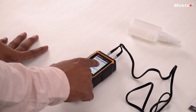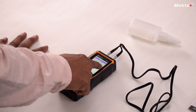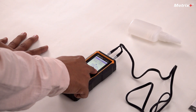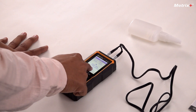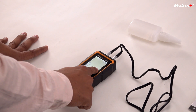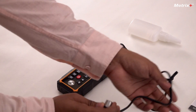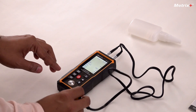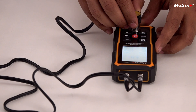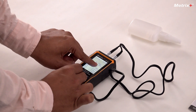So we'll select steel. I went on to steel and this is the enter button — I'll press enter. The sound velocity inside the steel material is shown; generally it is 5920 metres per second as shown here. We'll press enter again. Here you can see the material is steel and its sound velocity is this. Once the material is selected and the correct sound velocity is set, the probe just has to be pressed tightly on the surface to be measured. I'll spread the couplant a bit and then press it. You can see the value is 3.79mm.